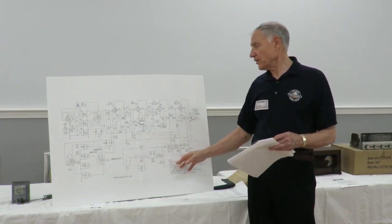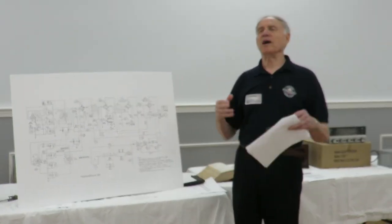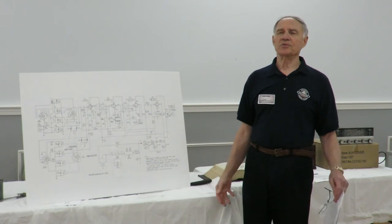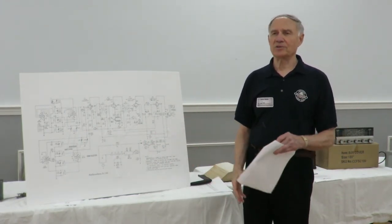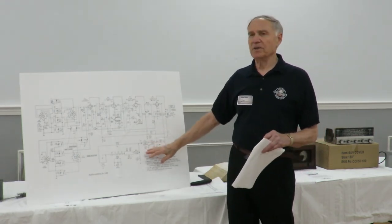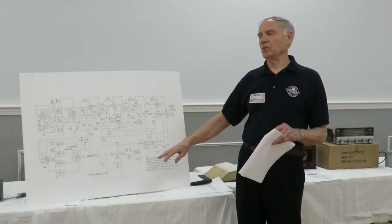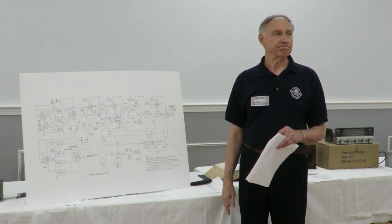If you have some serious failure, it's probably not so much in something like this, but if you get a more complicated radio, the power transformer could be bad, you put full voltage in there, and then there's smoke and all sorts of other bad things. But it's a good idea to limit the input current somehow, whether you do it with a variac, or with bulbs, or whatever. Some other questions?